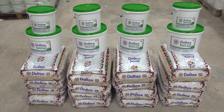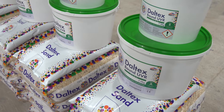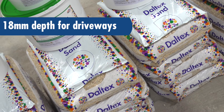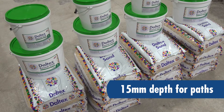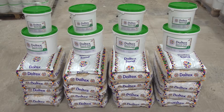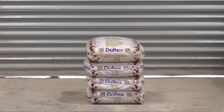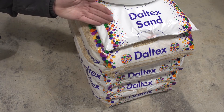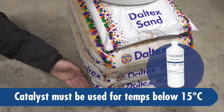Our experience and research shows that the correct ratio of resin to aggregates is critical to achieving a lasting, durable finish. To ensure the required tensile strength, we recommend a minimum depth for driveways of 18 millimetres; pathways with foot traffic only can be reduced to 15 millimetres. Our recommended mix for our 7.5 kilo UVR Plus resin pack consists of 3 bags of 2-5mm stone (75 kilos), one bag of 1-3mm stone at 25 kilos, plus a 6.25 kilo bag of C52 sand, giving a total weight of 106.25 kilos not including the resin content.